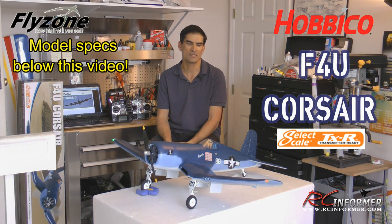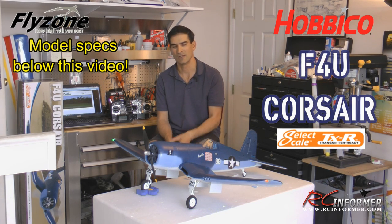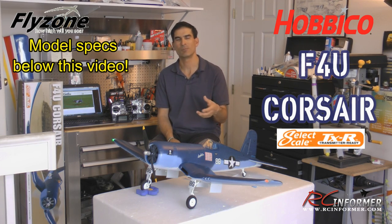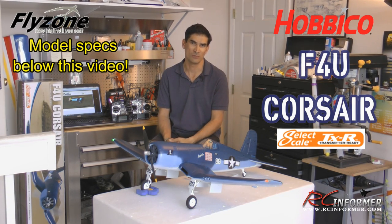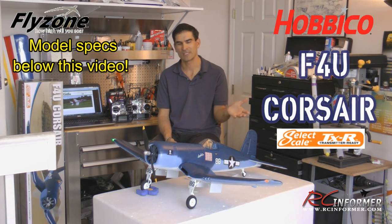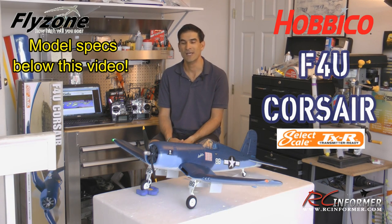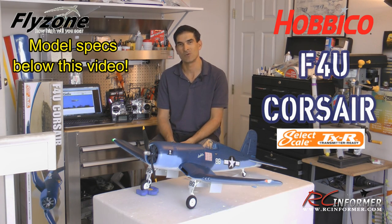What makes it efficient is the propeller and landing gear. A lot of guys have said it's too bad it doesn't have a four-bladed prop — but the problem with four or three-bladed props is they're less efficient, and you usually have to go up to four cells or more. Two-bladed props are so much more efficient that this airplane gets away with operating on only three cells. The performance you saw is on a three-cell 2100mAh pack — very impressive for roughly a 1200mm warbird.